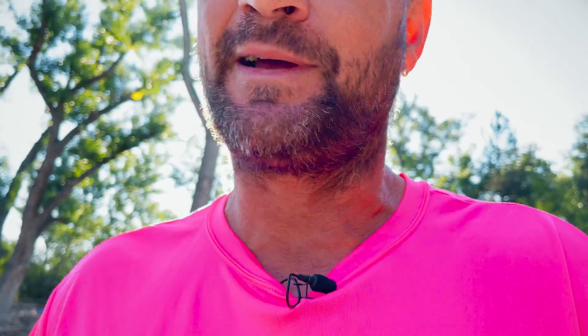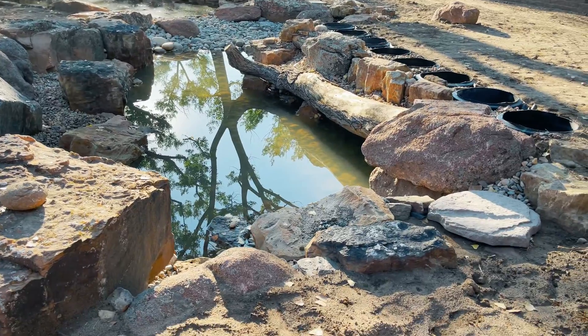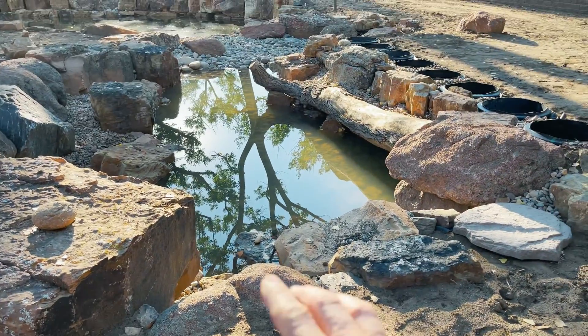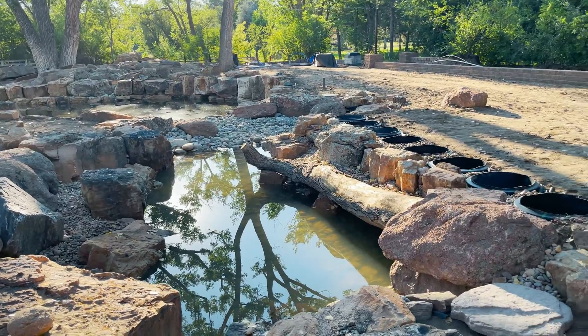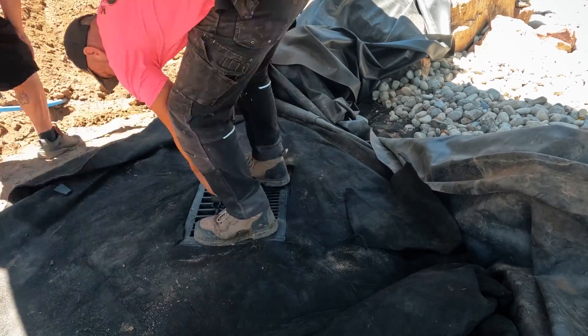That drain can handle a lot of water. This is a huge water feature — it's almost a million gallons, like 800,000 is where we're currently at on our guesstimation. I'm going to talk about what I'd do differently if I could do this over again. Super important that I always try to think: what will I do different, better next time? The answer is a second overflow. The surest way to not let your overflow get clogged is to have two of them. I could put one in the very back of the intake where all the debris pulls in, and another over to the side. It would be very simple to form and pour concrete, make those basins at the proper height, and then just fold the liner right over top of them and do the same type of compression seal.